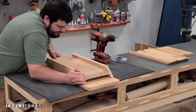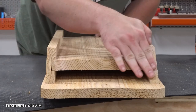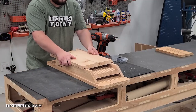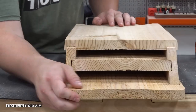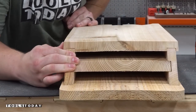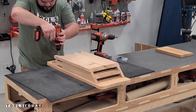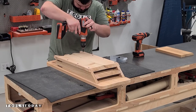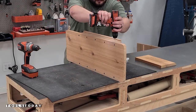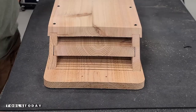We'll get the middle panel inserted up to the top of the side panel so that it's nice and flush — that's where we cut the 45 earlier. Then same thing with the front panel, getting everything all nicely seated in there. With the plans here, we don't have any glue in these pockets. We're just using screws to hold everything together so that we don't introduce any new smells into the bat box, which will further delay any bats entering the box. I'll then pre-drill and screw into the middle panel from the side panel.